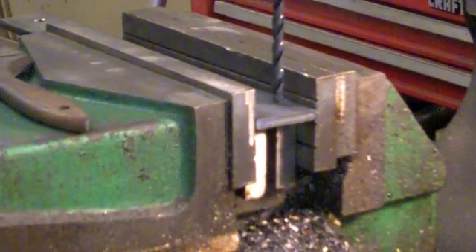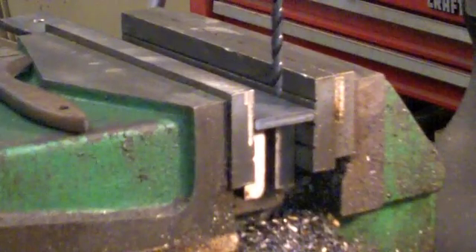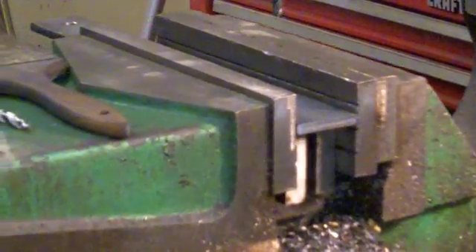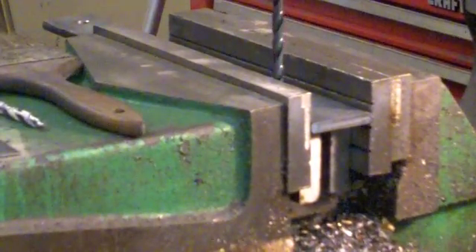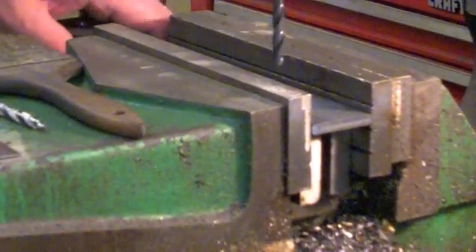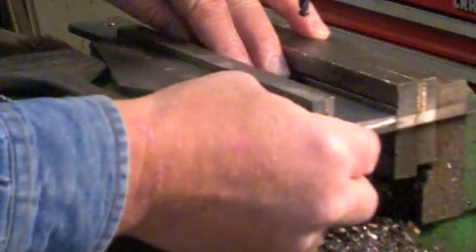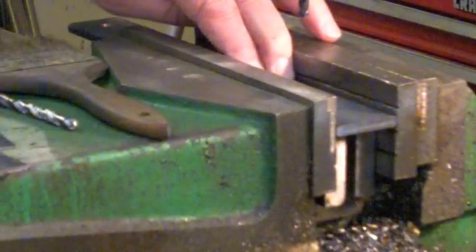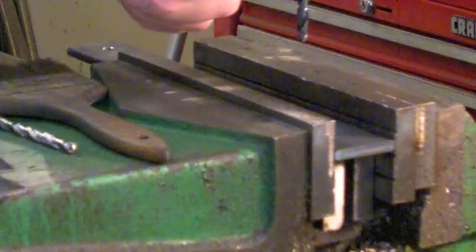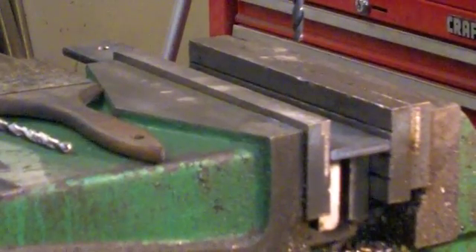If I had two or more brackets that I was drilling with several holes in them and I wanted them all to be the same, then all I would have to do after I finished drilling the last hole is to line it up and mark where our next hole was going to be. Using this as a reference, I drill this hole, put my next piece in, again lining it up on this corner, tighten it up, and drill my hole here. If I had to change sizes or do a different size, I could go all the way through and do multiple holes in multiple pieces of metal.